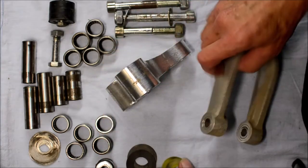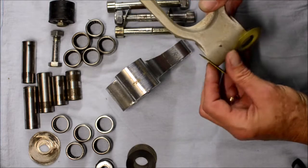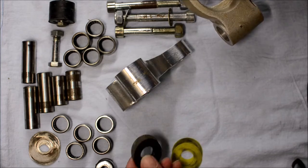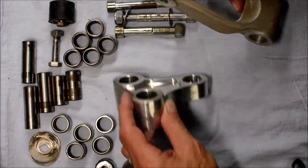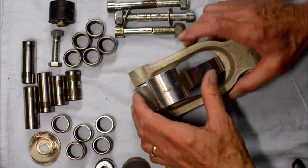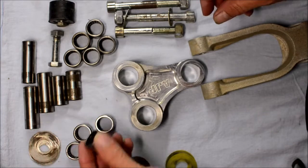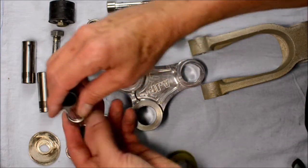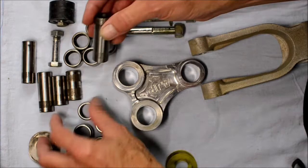The fork is secured from side-to-side movement at the front. These two are made out of some chopping board material — they wear as good as anything else and are surviving quite well — but these are half-millimeter and the clearance is supposed to be one millimeter. So the back of the fork has a millimeter of clearance either side. Now these bearings have an o-ring, which doesn't seal; it doesn't have enough friction to hold itself on the shaft, so water does get in.